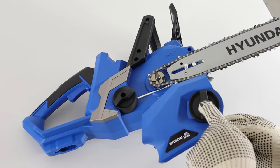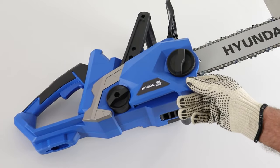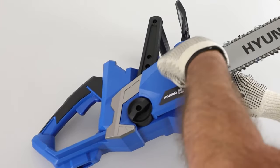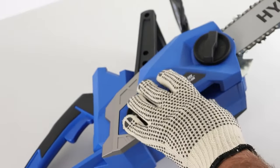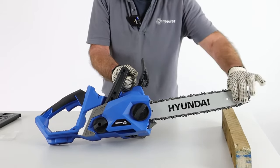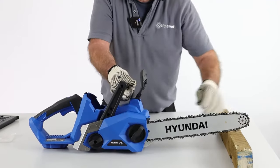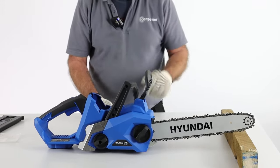At this point we can refit the cover. Inside is the thread which threads onto this stud. We locate it with the cutout around there and start turning clockwise to clamp it. I'm going to back it off so it's still loose — that's my starting point for chain adjustment. As you can see there is slight movement up and down in the bar. When we tighten and set it, we want the bar in the up position. I've got a piece of wood on the bench: if I put the bar down on it, it pushes up to its extremity in the up position, and that's the point at which we adjust it.